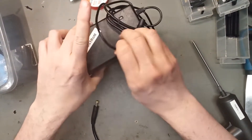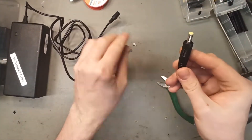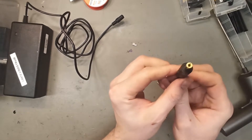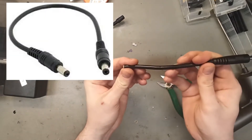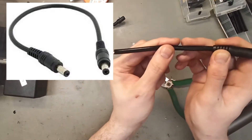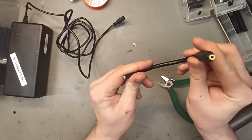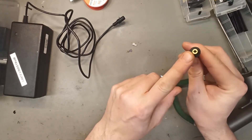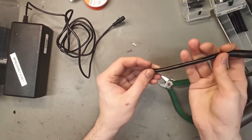Today I'm going to show you how to change the DC connector. Buying do-it-yourself DC connectors is not recommended — we have not found a single good one. The best approach is to buy a DC-to-DC male connector, which gives you two DC connectors. These come from a high quality charger, can handle four amps, come pre-molded, and are very high quality.